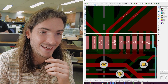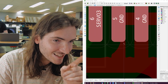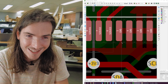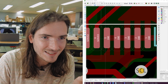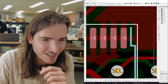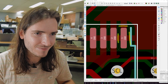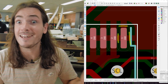It appears that in my haste to find a nice simple solution, I missed this bit right here — there's a ground fill that just sneaks in and connects to the pad, and in fact that's underneath the chip. There's no way I can cut that trace. And that's present on every one of these pins except pin one. Pin one is the only pin where I'm going to have to make three cuts to isolate it — I think that's address pin zero. I can isolate it with three cuts, solder a wire to go to VCC, and we'll have changed the address.